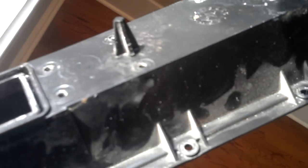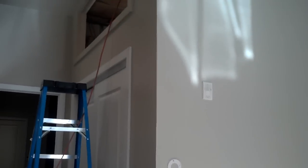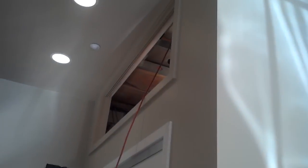Any condensation that goes into this box is going to flood out the inside of the cabinet — the furnace cabinet — which in turn is up in the ceiling here, flooding out inside the ceiling, which in turn is dripping through this diffuser up here in the ceiling that we've now taken out.